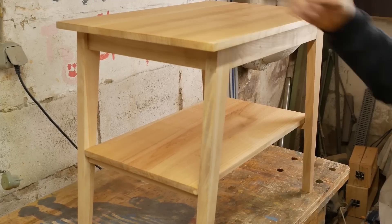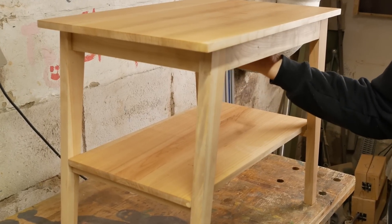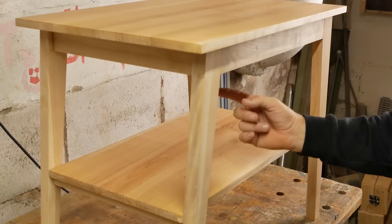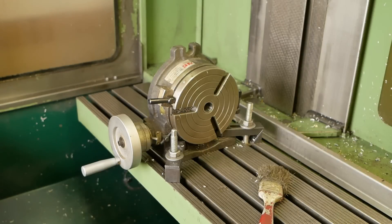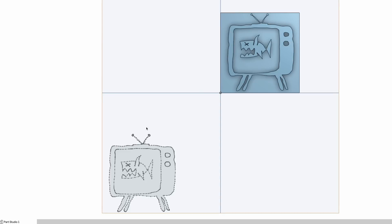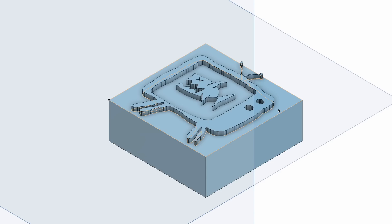When I do these projects in wood I tend to sign underneath with a name and a date, but I'd like to brand them with my Telefish logo so let's make a branding iron. To mill a branding iron on the CNC mill I need a toolpath. Back when I used to use Onshape I'd taken a photo of my logo, digitized it as a DXF, imported it, cleaned it up, and made a 3D model out of it, and that model was exported as an IGS file.